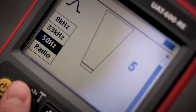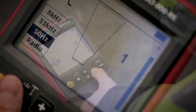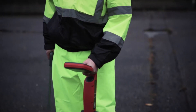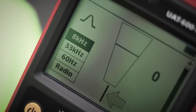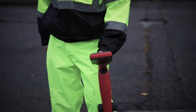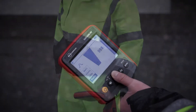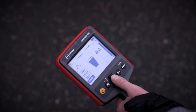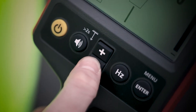The speaker will begin to indicate sound when the meter reading is above full scale approximately 10%. If the reading starts to increase, carefully move the locator in all directions to detect the maximum signal, using the bar graph to help confirm the correct position. If the bar graph exceeds the maximum value, adjust the sensitivity to bring the reading back within the limits of the bar graph using the plus and minus buttons.